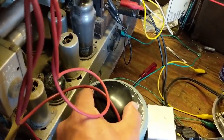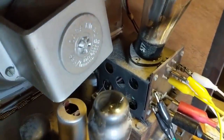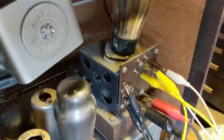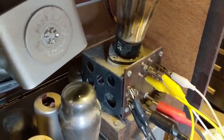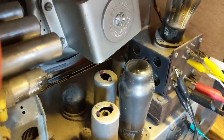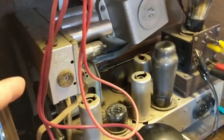I tried it yesterday and I'm getting nothing — it's dead. Completely dead. I'll bring it up all the way to 110 volts and there's nothing at all. There's no tube filaments. And it's interesting because we have two fuses: one for tube filaments and the other for the stuff going into the power transformer — or rather, the other side of the transformer, not the six-volt winding. Here's something interesting — this is why I got this set.